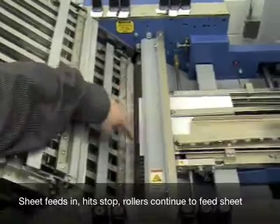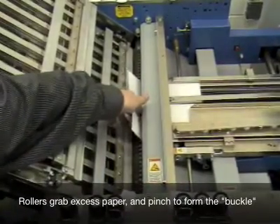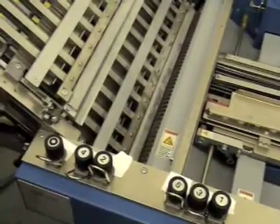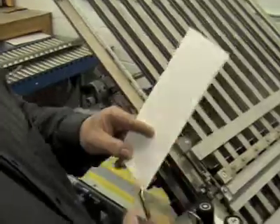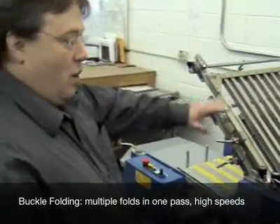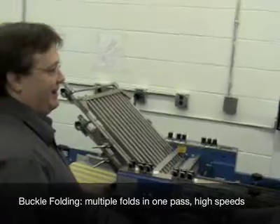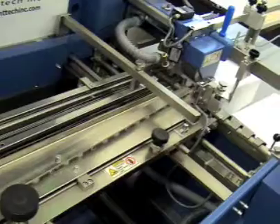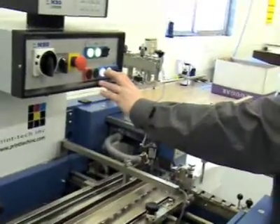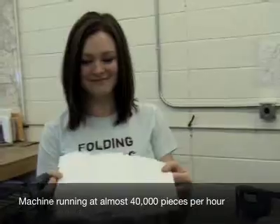The sheet runs down the register board and comes up between the rollers. It hits the plate — my finger is demonstrating the plate here — and that causes the sheet to buckle and go between more rollers. It takes it through to any other open plate. In this unit you can do four folds, and with a second unit you can either run straight and do four more in the same direction, or turn it at a right angle and do four in the other direction — so eight total in one pass, or nine with a knife folder on the end. We are making a ladder fold.